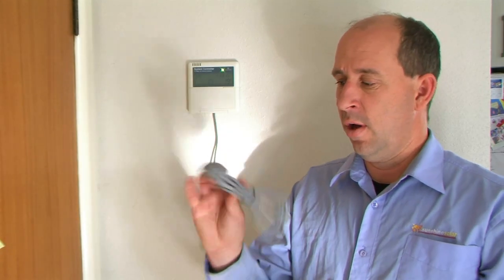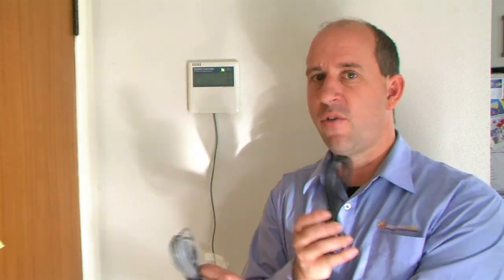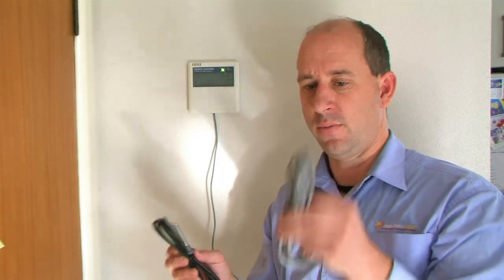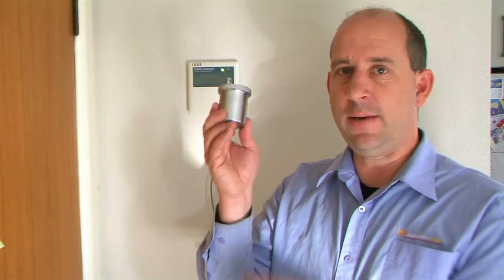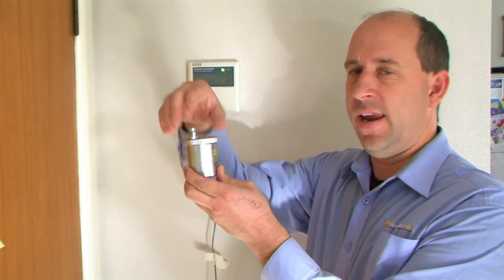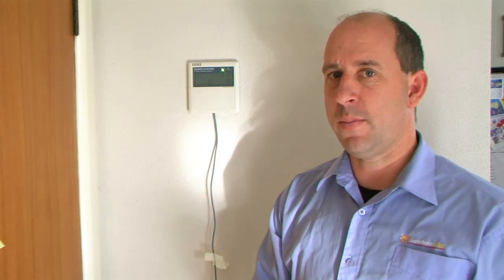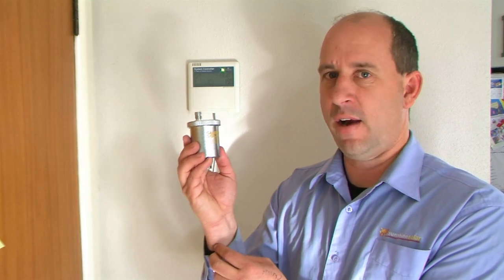Next we've got the thermocouples — these measure temperature. The grey one is for measuring the collector on the roof. It's essential that you get the right thermocouple for the roof and the right ones for the hot water cylinder because they have different resistances — if you get them the wrong way around you'll get bad measurement. We use different ones for the failure mode: we want the roof sensor to fail cold and the cylinder sensor to fail hot for safety. The last feature is the steam vent — this goes on your roof next to your manifold. It has a little float inside; if you get air or steam in the system the float will drop and allow the air and steam to evaporate off. If your system is set to a maximum cylinder temperature of 80 degrees, it will release excess heat out of one of these — so don't be worried if you see steam coming out of that. For a mains pressure system it will more likely come through the cold water expansion valve in the bottom of your cylinder.